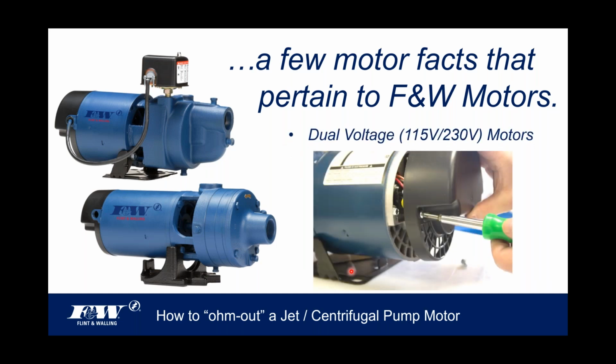All of our motors are dual voltage. I want to show you how to change that voltage. So they're going to be either 115 or 230 volt. Most of the jet pumps probably leave at 115 volt factory set. Most of the centrifugals, if not all, are going to leave factory set at 230 volt. But irrespective, if you want to change the voltage on a Flint Walling motor, it's pretty easy to do.